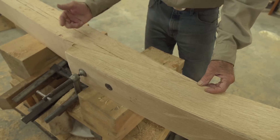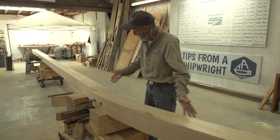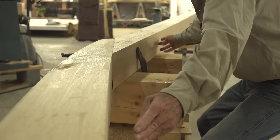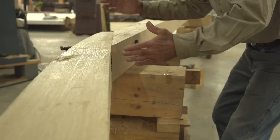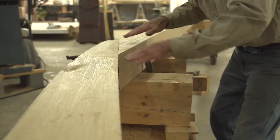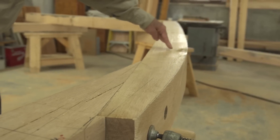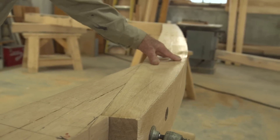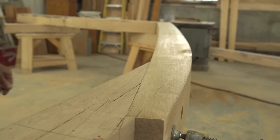We couldn't make this thing any longer because cutting across this diagonally is as long as you can get it. So what we're going to do is put a spanner inside here — just a piece that's another six inches — going from way over here to way over here to make this whole connection a lot stronger. It's going to be bolted right through the whole thing with big long bolts. This is going to be a very solid area in this boat. This was the most curved piece that I had, and that's what I wanted — a nice gentle curve to the forefoot. It gets accentuated at the ends by cutting across the grain, and this really served the purpose nicely. It's not going to check open and do anything.